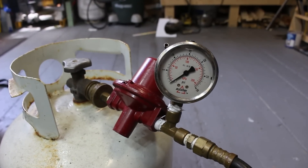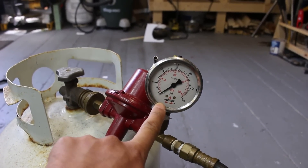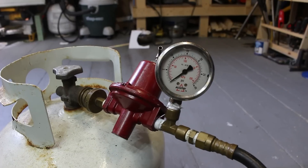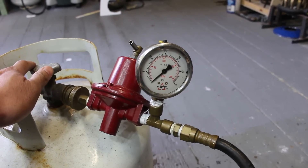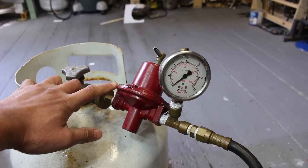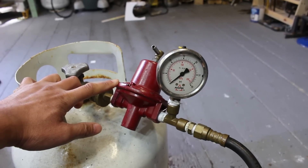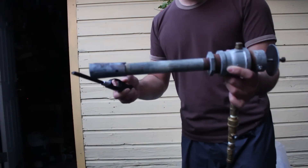The last thing to mention is the high-pressure regulator — it's the key to this system. They typically come in red. Mine is hooked up to a PSI gauge. You need something with a gauge so you can tell what PSI you're operating at. This is an adjustable regulator, so you can go from 0 PSI all the way up to 20 or 30 PSI depending on the regulator you get. The red color denotes it's a high-pressure regulator, unlike a barbecue regulator, which is silver and low-pressure. I have the burner connected and running at about 3 PSI.